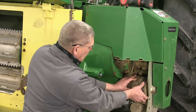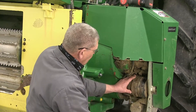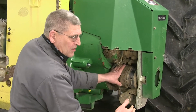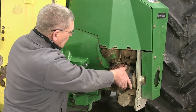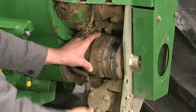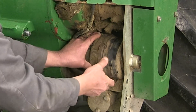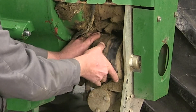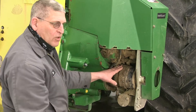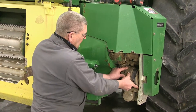On the outside cover here, there's kind of a tin cover, and that should be loose and free — sometimes even rattly — and that's okay. Next is a cam ring in here. This is what the stop dogs tripped so that it disengaged. This cam ring needs to turn both directions and jump back to neutral. You can see this one's kind of stuck — it doesn't want to return to neutral, I can barely turn it that way. This one really hasn't been greased for a long time, but we've got to get that freed up. We're going to pump grease in here, spray this whole thing down with penetrating oil, and work that cam ring back and forth until it runs free. As soon as we let loose of it, it'll just snap back to neutral.